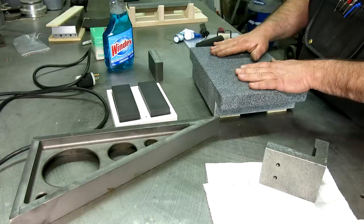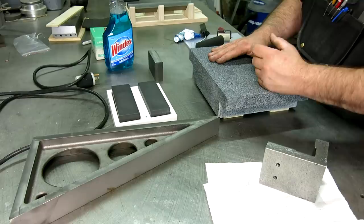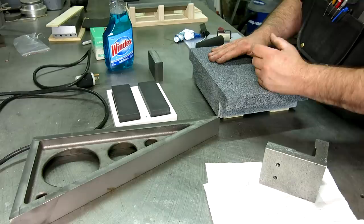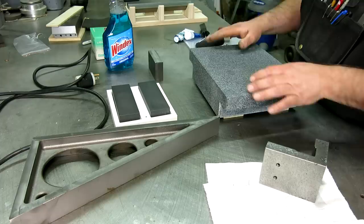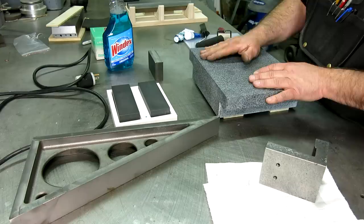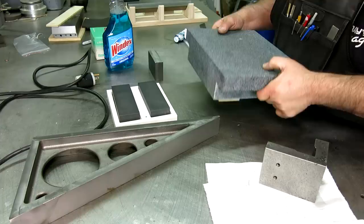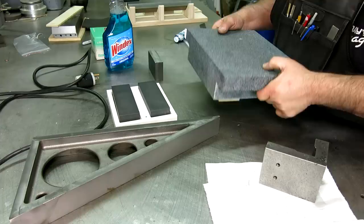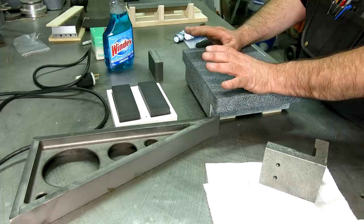This is a cheapo import surface plate from Shars — it's a nine by twelve with a two-inch ledge. I'm going to be doing some lapping demos and clinics down at the bash this year. It has a nice clamping ledge for foil lapping. From Shars this was $26 — can't believe they sell it for that. It's supposed to be grade A and seems pretty good. I put some plywood block feet on with Loctite 380, sitting on three points — something Richard talks a lot about: supporting machinery on three points to measure and do your detective work.